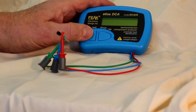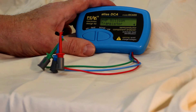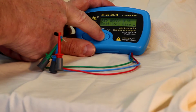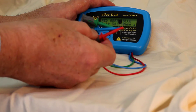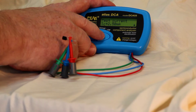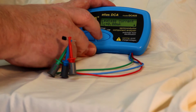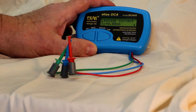I just connected this particular device and let's see what it does. It says it's a PNP silicon transistor. Scrolling down shows the pinout: red is connected to the emitter, green to the collector, and blue to the base. It calculates the current gain and gives you the test conditions — collector current, base-emitter voltage, base current — and then checks for leakage current. If there is any leakage current, it deducts that from the gain calculation so the result is actually accurate.